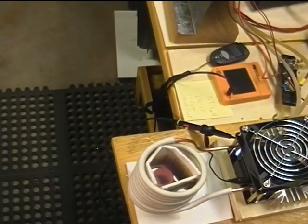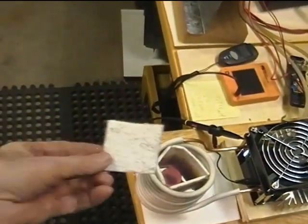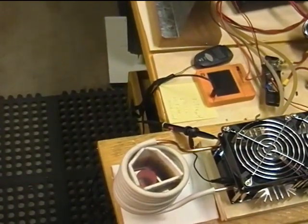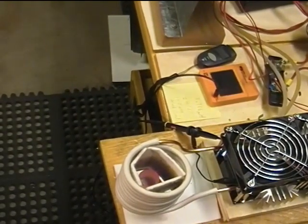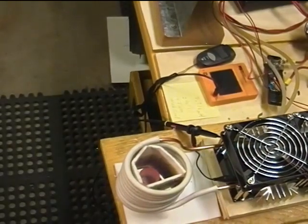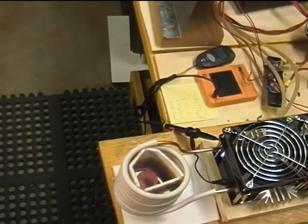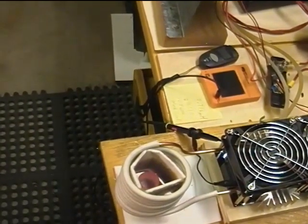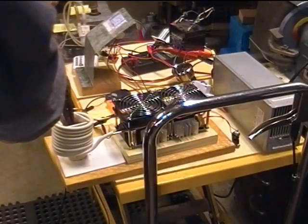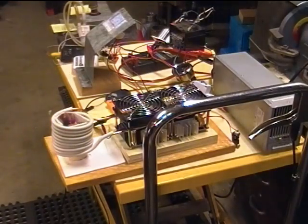It helps to insulate things a lot. So, you saw the insulation I got there. Here's a piece to put on the top, and all that sort of helps when you're trying to get something really hot. When I was heating the copper, I had forgotten, but I really should have been putting a lid on there, because that copper is radiating, and so is the crucible, radiating a lot of heat up and out. At any rate, I guess that's it for today. So it got hot, but not really.